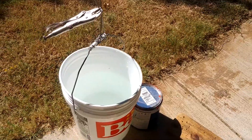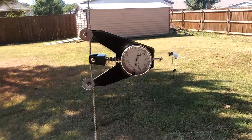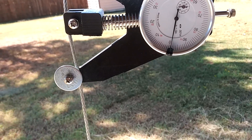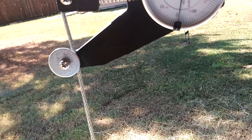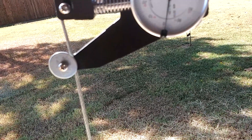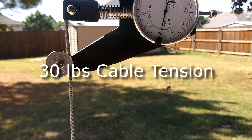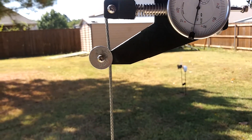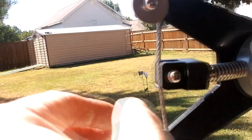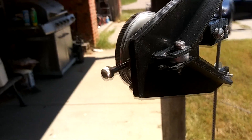The vise grips were almost a pound, so I hung it and suspended it — that's 30 pounds of pull. And 30 pounds of pull equals that reading on the gauge. My gauge zeroes out over here, so we're at about 55 thousandths — yeah, about 55 thousandths of travel that the spring pushes the cable back.